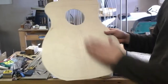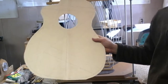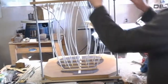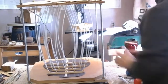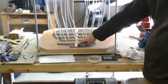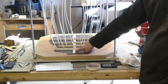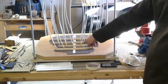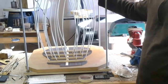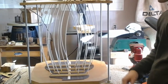I've got the bracing pattern laid on the back, and that's where the braces will go — you'll see that later on. The back is braced. I used leftover excess material from the top to make the back graft, then cut my back braces to size. I used this go bar system to clamp them, and I can clamp all the braces on the back at once without having big clamps all over the place.